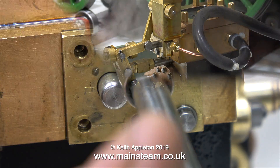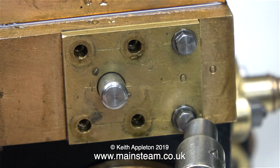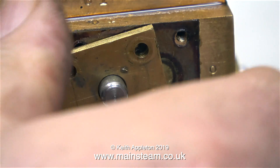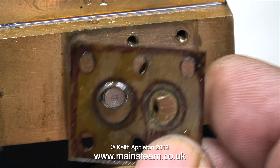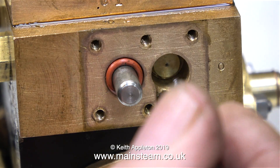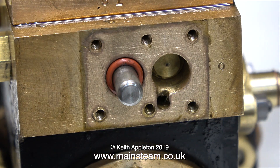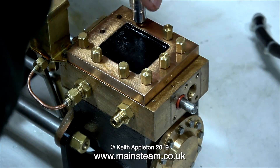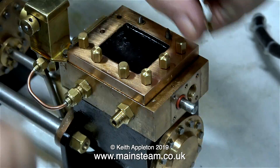I turned off the gas and let the engine cool. Once again I removed the end cover. And after removing this cover for the second time, it's no surprise to me to find that the shuttle piston is at this end of its travel. When I press it with a screwdriver, the shuttle piston sticks and then it moves. The engine's still fairly warm at the moment, but it's not really the temperature of very hot steam.